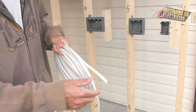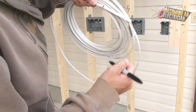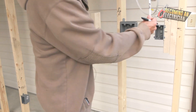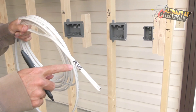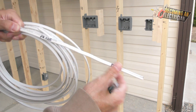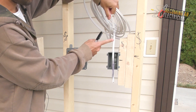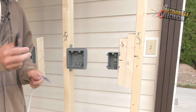Pro tip: do not label right at the very end of the wire. A lot of people write 'plug' right at the end, but when that wire goes into the box you strip from that point and you lose your marking — that's silly. Instead, label up a little bit higher on the wire. That way when you staple and leave your service loop, you still have enough wire and you still have your label visible.